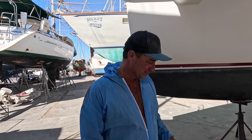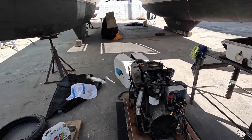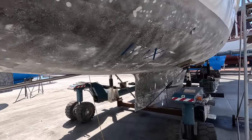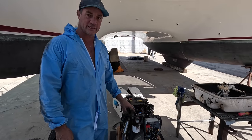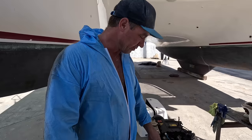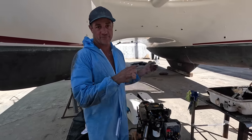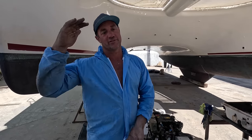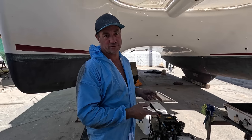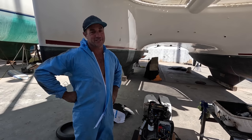We might as well reinstall it — it's got a thousand hours on it, which is absolutely nothing for this little thing. If all goes well, 9kVA generator for two cartons of beer — can't go wrong. Thanks Nick and Jasmine, we know this was a headache for you but we're hoping it's going to be great for us. The water pump here doesn't have an impeller in it, so I'll clean that up, put a new impeller in, set a bucket of water up there, and put a battery up there. It's a massive heavy box that drops three-phase down to one-phase. Only problem is this one is 240 volts and our boat is 110, so we're going to get a Victron converter to change it from 240 down to 110 — emergency power. The biggest thing for us is we're hoping to get a dive compressor at some stage, and this will run an electric dive compressor.